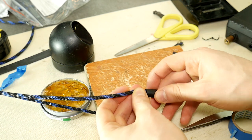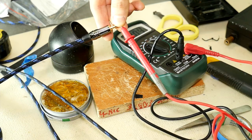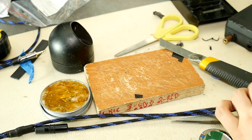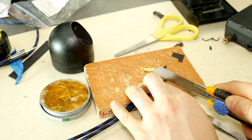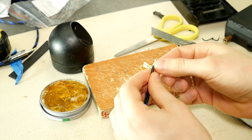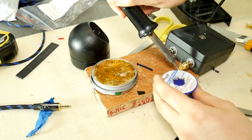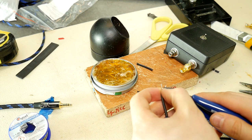It remains to install the two RCA connectors. Carefully remove the outer insulation rubber of the cable, separating the shield from both center cores. Use a multimeter to check which wire is left or right channel. Before proceeding, it is important to get the RCA connector housing onto both cables — otherwise it will no longer be possible after soldering. Remember to put the RCA with the red mark on the wire which is the right channel. Align the lengths of the two cables by trimming them so one is not longer than the other. Carefully remove the outer insulation rubber and separate the shield from both center cores on both cables. As a result, you should have two wires of the same length, prepared for soldering. Tin them both so the RCA plugs can be soldered better, then tin the RCA connector contacts. Measure the wire and trim any excess length so it does not interfere with soldering.